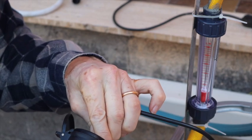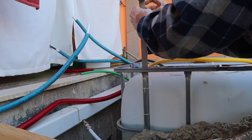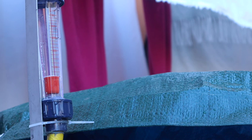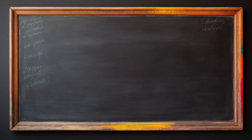This model from Amazon had no thread, so not easy to make it watertight. Better keep it at lower pressure — so install it before the pump. It was a great help to see if water was flowing in the central heating circuit, just to check if the pump was working. Calculate the thermal power according to the formula above. A quick calculation help: each 1000 liter per hour gives 1.2 kilowatt for each delta T of 1 degree Celsius.